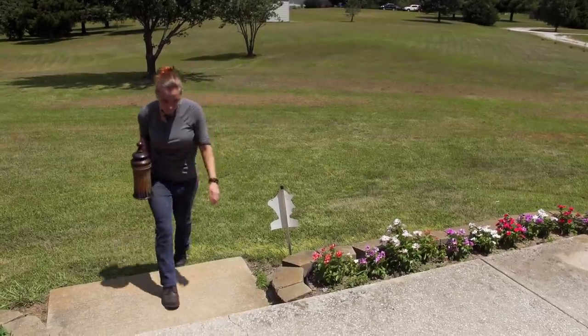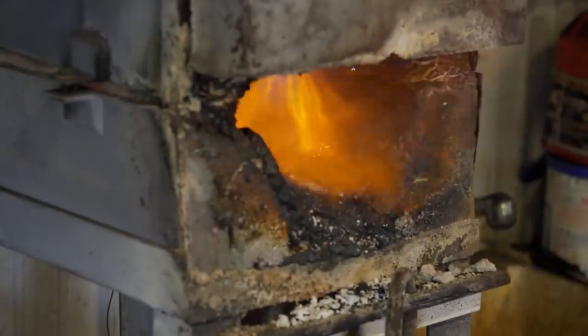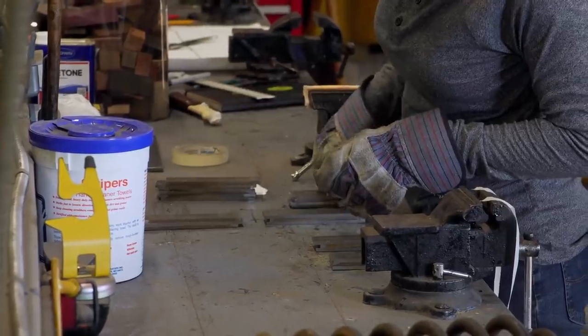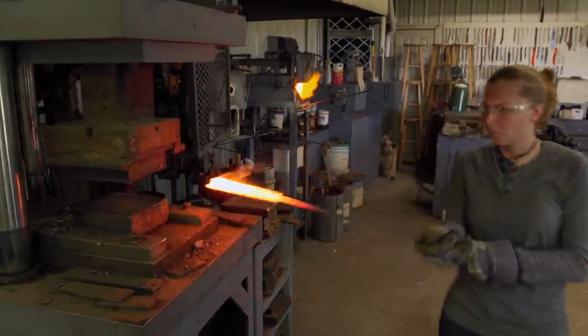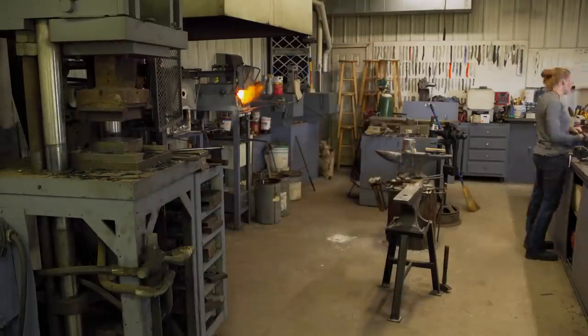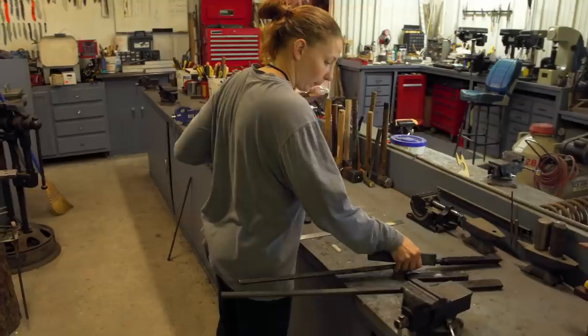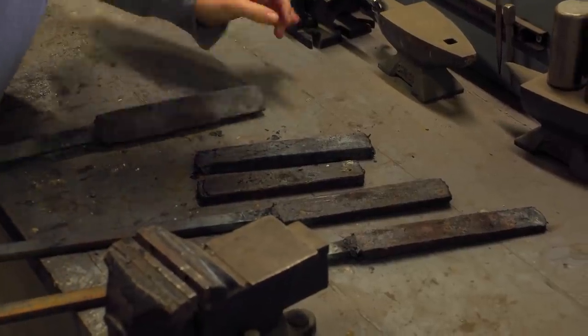So I'm back in Ozark, Missouri, in the shop I share with other local knifesmiths, and I'm going to be working on the Pyrrha. Most of the knives I make stop at the longest at about eight inches, so just the size of it is rather daunting. I want to be able to bring something to the judges that they will say wow. So I decide to go with a Damascus pattern using 1084 and 15N20. I'm going to make a handful of small billets that I will eventually combine, because one giant billet would be really hard to work with. I need to clean up the faces that'll be touching, simply because it'll help for a cleaner weld. At end of day one, I have five tiny billets that I'll start combining on day two, and that will be the basis for my sword.